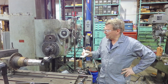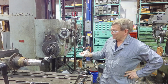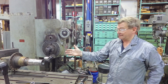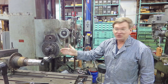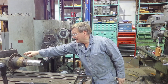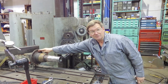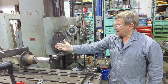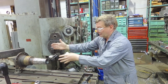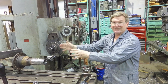The big thing that people can tell you the first couple of times you work with these — if you don't know this, it'll really mess with your head. You don't dial it in here and dial it in at the other end. These are not straight. Once in a while there will be one that's straight, but the majority are made with a little bit of an offset. This axle is straight from bearing to bearing and should be straight to the seal, maybe fairly straight to the mounting for the brakes. But in relation to the opposite side, it will be slightly off toward center so that when the wheel weight is on the bearing, it comes back to approximately straight.